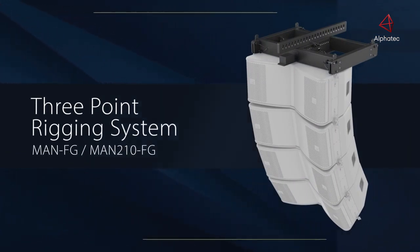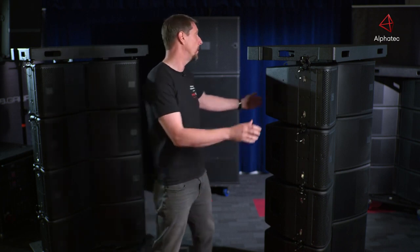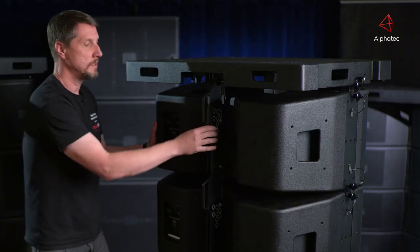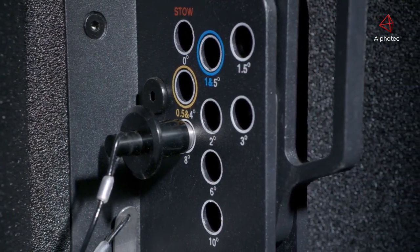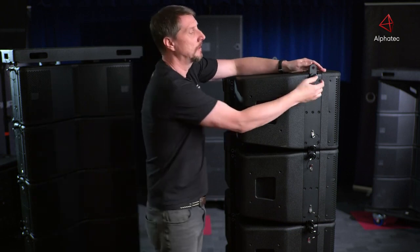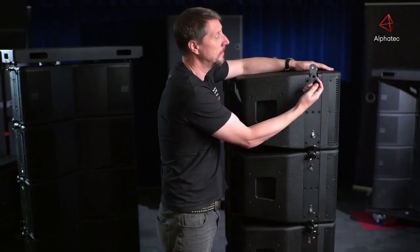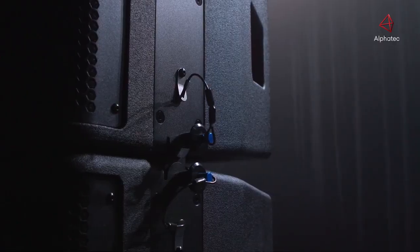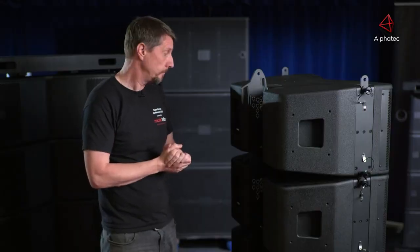The 212 and the XV come with a three-point rigging system. Everything is integral to the box — you don't need to buy any extra pins, and everything is also lanyarded to the box. If I move this round, you can see the third pickup point, and all of your angles are marked here. Our front two pickup points are spring-loaded, which enables the pickup point to leap out of the box and makes for a smoother rigging section. Just replacing pins back into the holes they've come out of will make the system secure. A third point at the back means that one rigger can put it together.